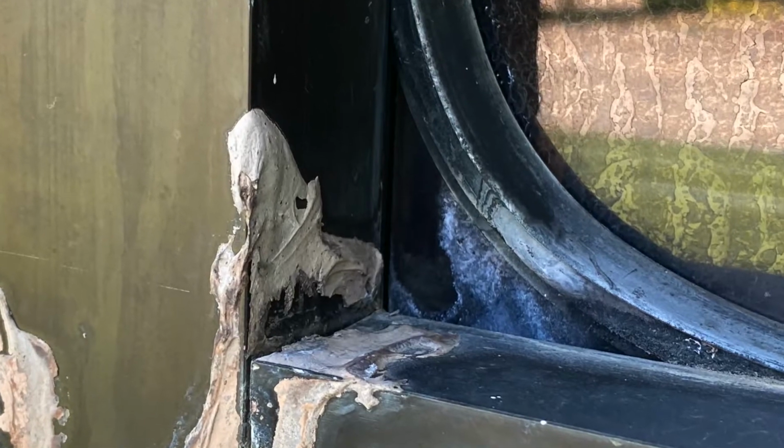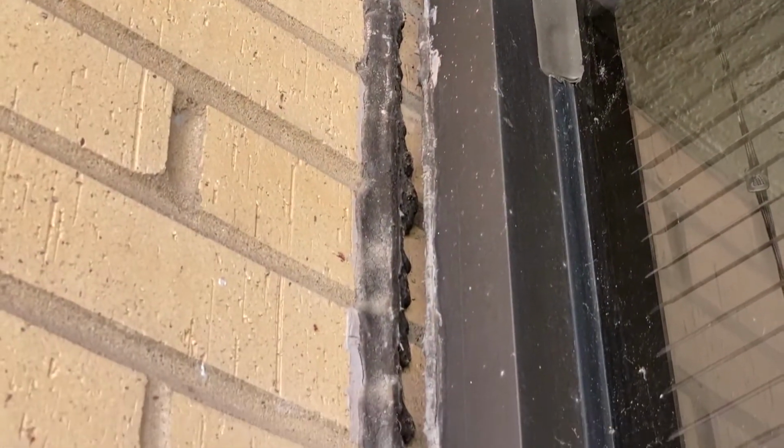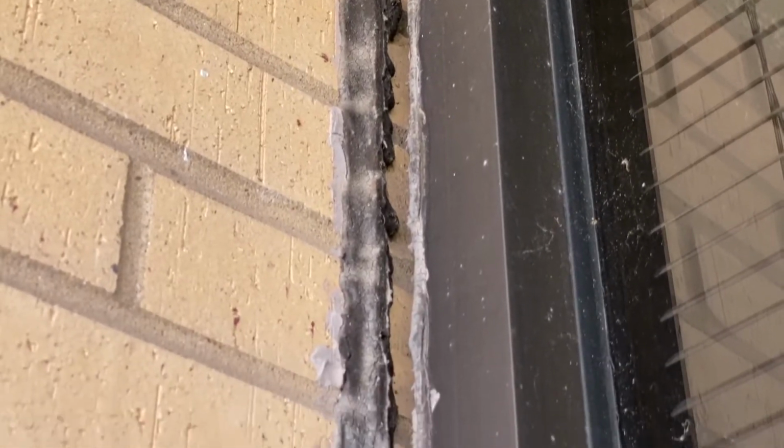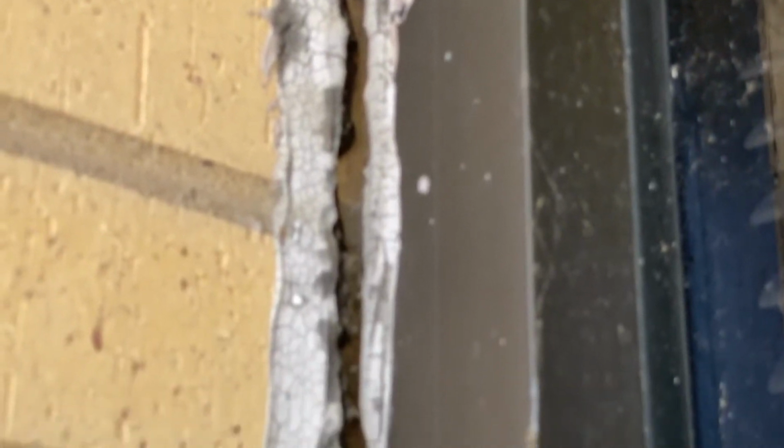The sealant around the windows, from glass to frame, was really deteriorated. The gasket was falling out in a lot of places. It was crazing, so a lot of shrinkage was coming in from that. That contributed to some window movement, and obviously some energy loss. And as you look at the exterior of the frame and onto the substrate, it was just really nasty, with a lot of short-term repairs.